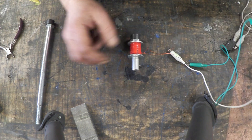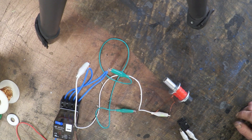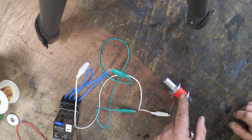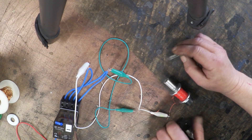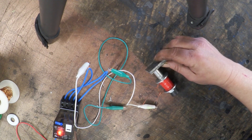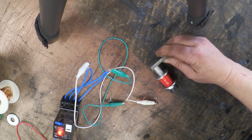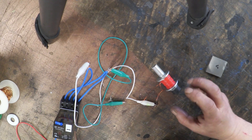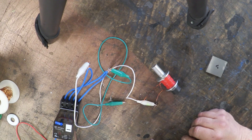I've got this arranged as an H-bridge — there's the H-bridge arrangement. When I put power onto that and it's not closed, it's making the magnetic field in the core one direction so we get absolutely no attraction at all. If I swap it, it swaps the field in the other direction and it becomes a very strong electromagnet. So we can turn the magnetism off completely or turn it on completely. This increases the force of the electromagnet dramatically, and that's the point of them.